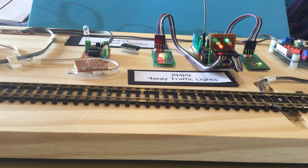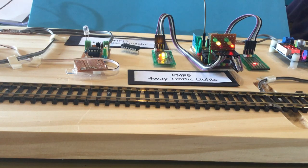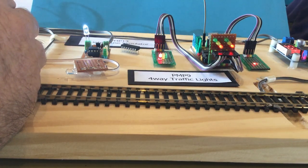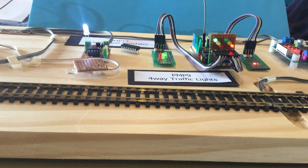If I block it anywhere in the bank 2 sequence it will still remember that and operate quickly on the other side. So we're green here — I'll let it go to red, I'll block it, and it'll go to red and come straight back up again. We never show people lined up to cross the railway line a green signal or even a yellow signal. Those were the best things I could think to make it do.